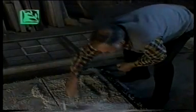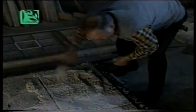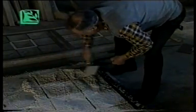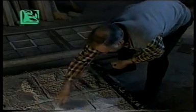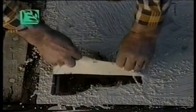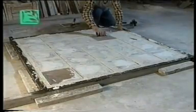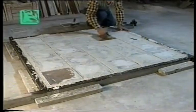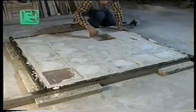Mortar is again poured into the appropriate areas, taking care to prevent air bubbles from forming by continually inserting a trowel in the spaces. Now you remove any protective plastic covering and wait for a few hours for the mortar to dry. Excess material is then removed with a palette knife and wood shavings.